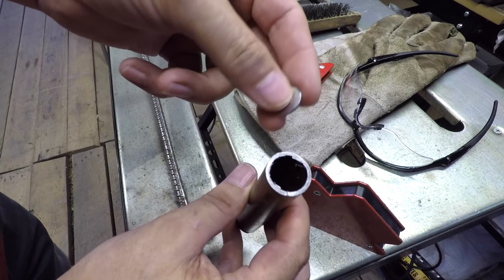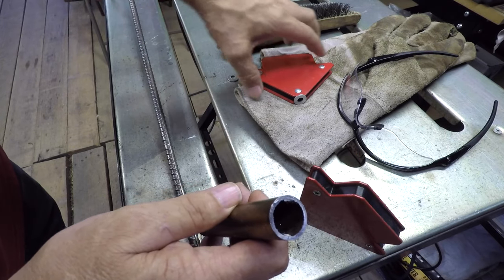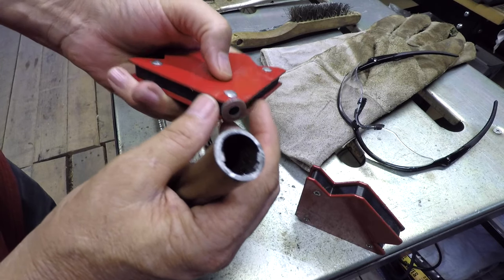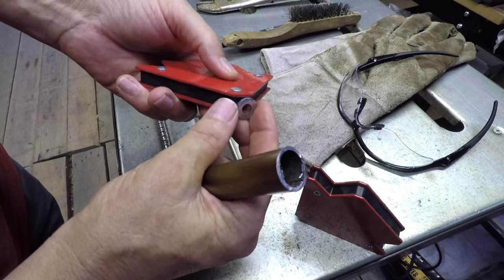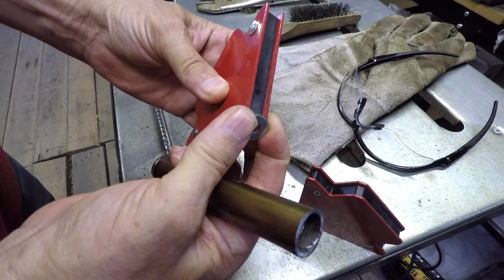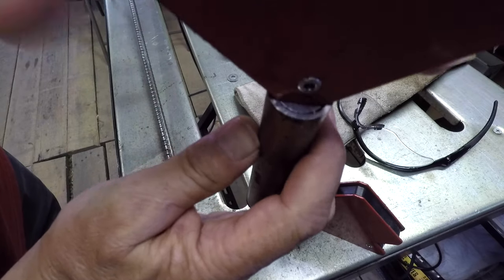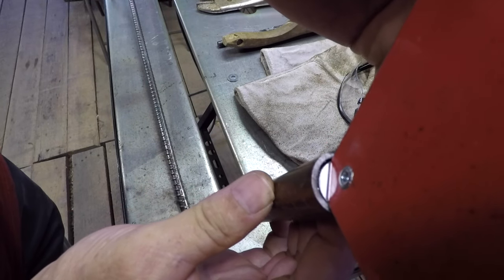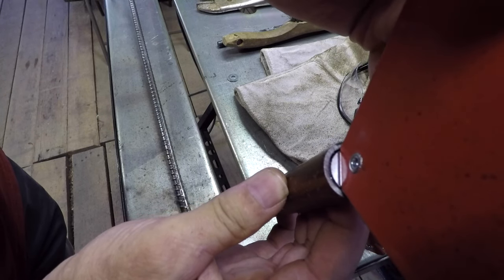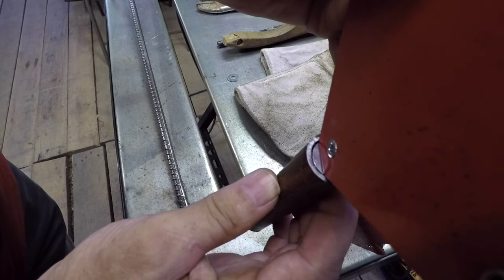If you're an experienced welder, I'm sure you've known that trick for years — I'm just now learning it. I recently welded some very, very thin sheet metal with that method and it worked really nice. So what I'm going to do is put this washer on my magnet, kind of offset it, use that to hold the washer in there, then put a tack weld, move the magnet, put another tack weld, and tack weld all the way around to fill that little gap. We'll see how that works out.